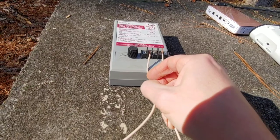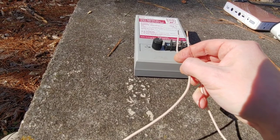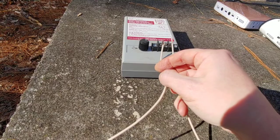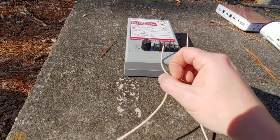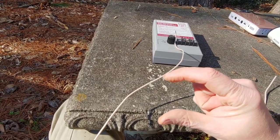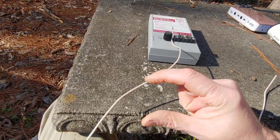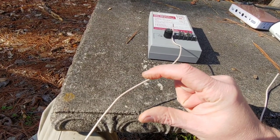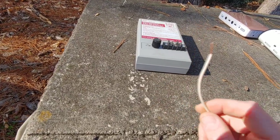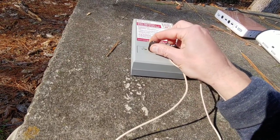The system has to be intact because it's transmitting an AM signal — very important. It's transmitting a radio signal under the ground, and when your pet gets close to it with its collar and then starts to cross it, it makes that warning beep, or if you've got it set to shock, that's how it delivers the shock. Is there any voltage going through this wire? No. It's a radio signal — the voltage is tiny if it's going through it at all.